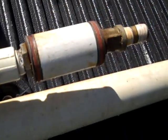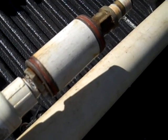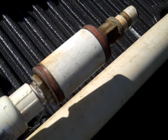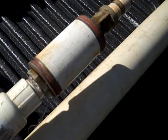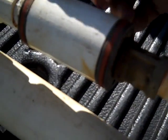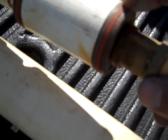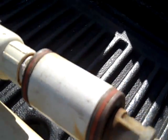The piston on the hand pump — there's a video I have that you can go back and see, I think it's called a slap shot. There are a lot of pistons out there like this, and I just made it a little bit different. Instead of putting the gaskets right next to each other, I spread them out. I just cut these out of rubber with scissors, a little bit about the same diameter as the ID of the two-inch PVC.